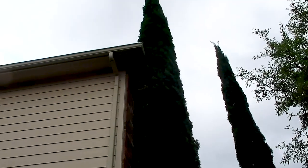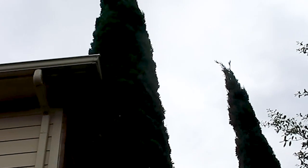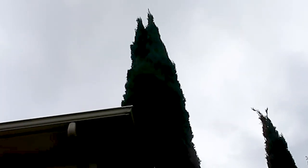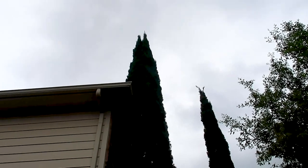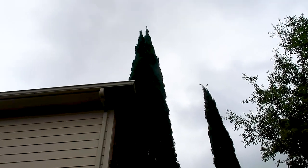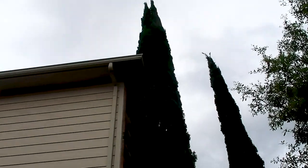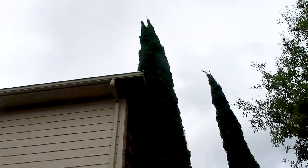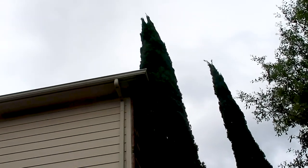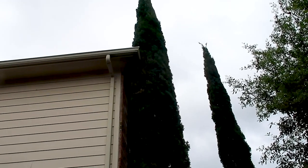You want to get the trees off the roof. This is an easy area for water leaks. You can even see right here the trees blowing in the wind — they're scraping across those shingles and will eventually cause a hole. Carpenter ants love this type of stuff: they'll live in the tree, crawl in, eat up your wood, and come back. Easy call-out for a home inspector and easy maintenance for a home buyer.